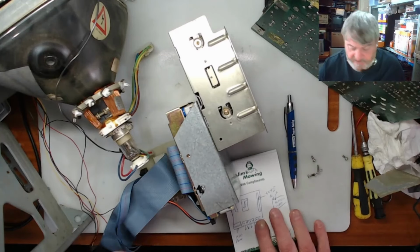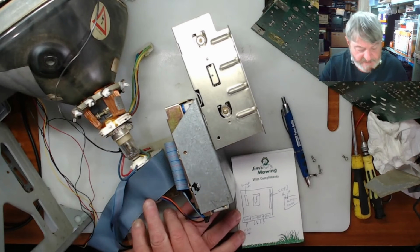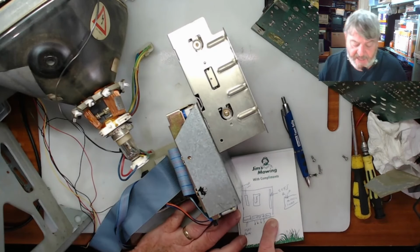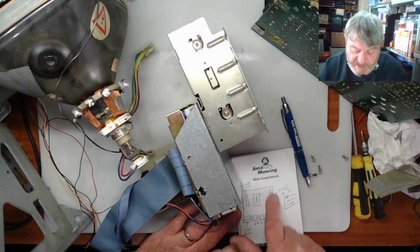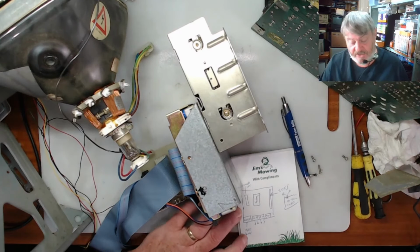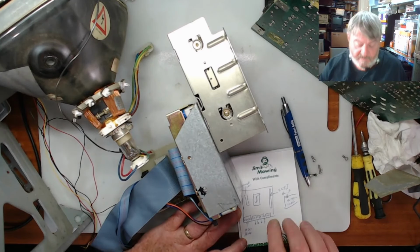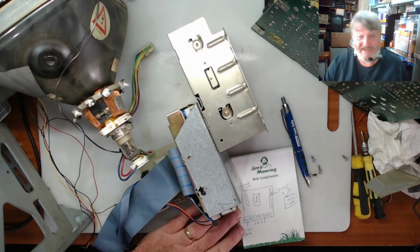Okay, so I just went through and I was checking off what's what. So I've drawn a picture of the SCSI board, or the SCSI daughter board for this, and it has four connectors at the back, and then it has a small IDC, the large SCSI IDC, and it has the 40 pin header that goes down to the chip on the motherboard. Now these back ones here, they're slightly different colours. Now one I think was power in from the motherboard, which is on the board itself. That'd be quite easy to trace, and it has a diode over the back of that socket.